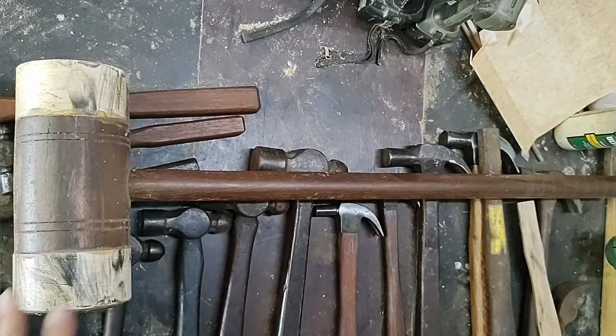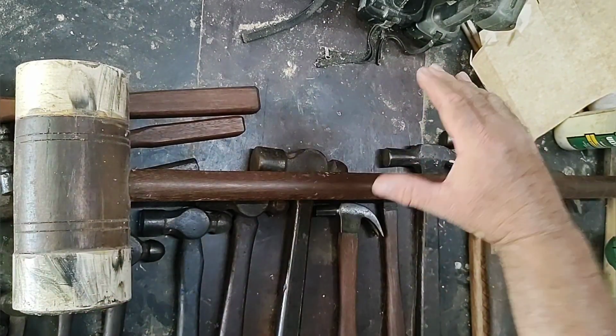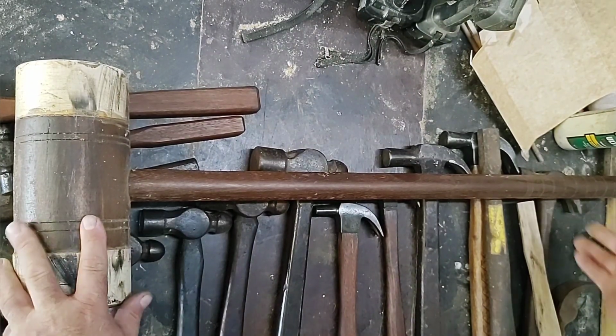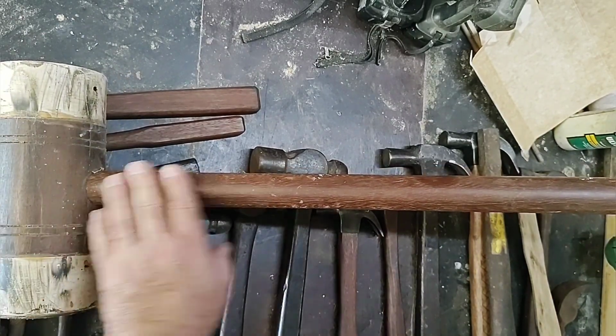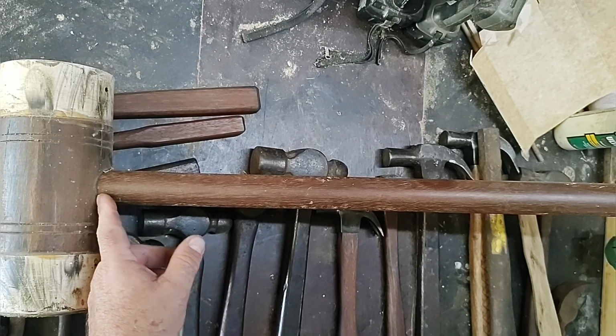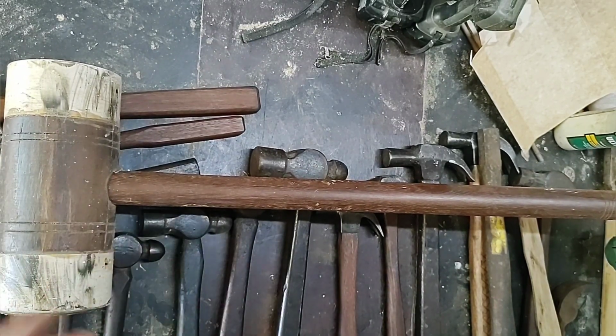And that's how I did it. I had a bit of rubber car tyre down the bottom that they had to hit, which was on a lever, which struck a weight that went up and rang the bell if they managed to get that high. But that's a hammer handle there that is made. That handle was turned. So as the head turned, I drilled a hole for the spigot and simply put a batten screw in the other side to hold the handle in after I glued it.